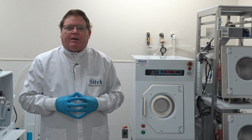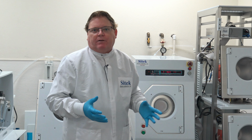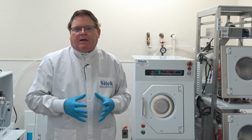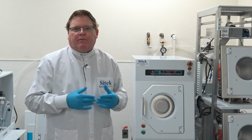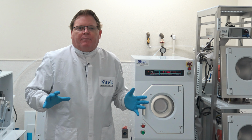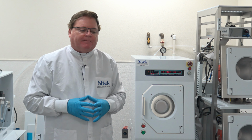So to talk about our remanufacturing process, at Sitek, we remanufacture our customer's tool just like we build them ourselves. In this case, a customer sends a tool in. The first thing we do is we evaluate it to find out the condition of it and if there's any broken or missing parts. We then break it all the way down to the base platform, and we start the reprocessing. We have our own in-house reprocessing of the bowl. All the metal parts are sent out for electropolishing. We then go through all of the door seals, the heaters, the heater blankets, windows. We rebuild the motors, the rotor stop positioners. I won't go into detail, but our customers get a full remanufacturing spec of what's replaced automatically new and what is checked out and rebuilt and replaced if necessary.